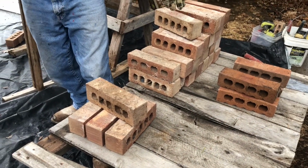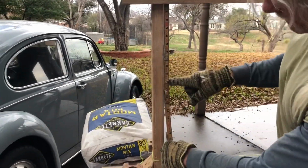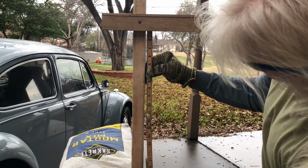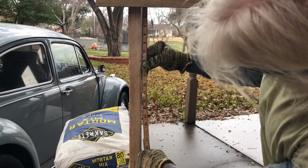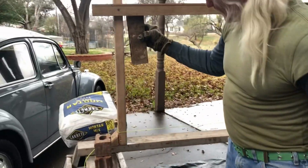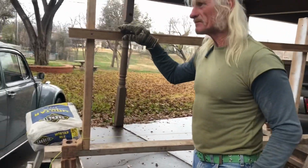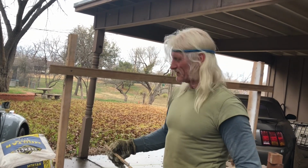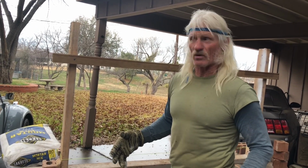They vary sometimes. So what I'll do is I'll measure from this molding down, and I'll mark it at 9. That way, 9.5 will go up under, behind it right there, which will be a joint above that last mark. See there? It'd be just like that. So, in other words, this should end out right there. So that's the first thing we do, is start from the top, as long as it's fairly level. I know remodels, you gotta watch that, but new homes, most of them are pretty much on, kinda, sorta.